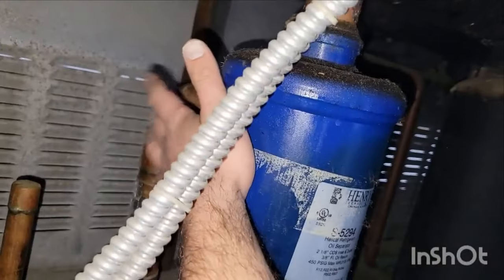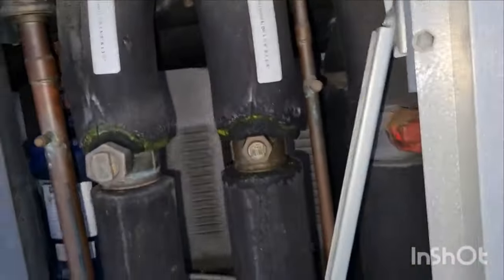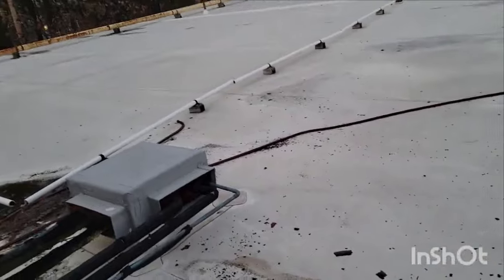Also, just to mention, if you were to take a pressure differential across this, you would have to hook up on this side, and then the top side of it, anywhere along it. So you could hook up along that suction header and then along where that discharge goes, anywhere, to get a differential across it. Some of them even have their own little gauge on it. I'll show it at some point.